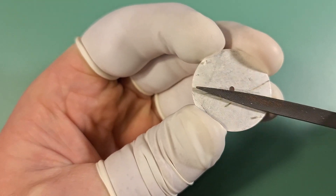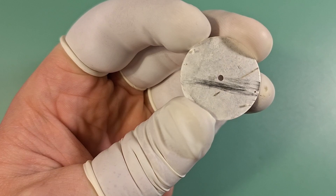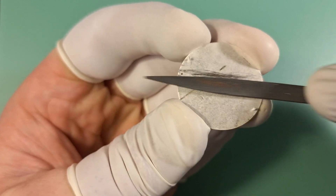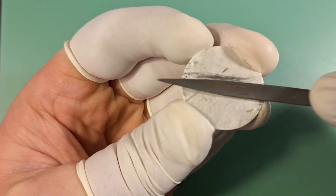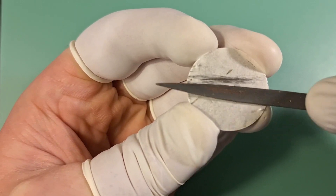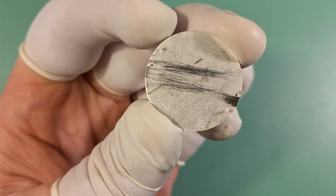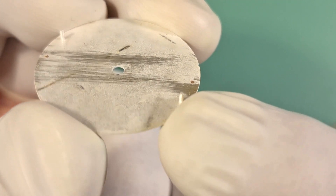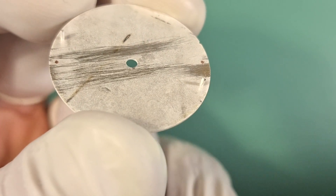This does not take very long. Dials are always made out of pretty soft material, usually some kind of brass and copper. This is not sped up — this is real time. It does not take very long to remove that tiny bit of material. We'll just go ahead and file that until it's completely smooth, making sure that everything is nice and flush. Taking a closer look from the side profile, you can see the dial is completely smooth and we've removed all that extra material.